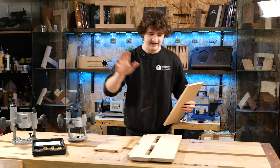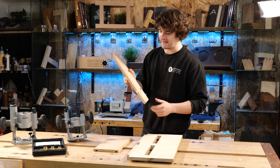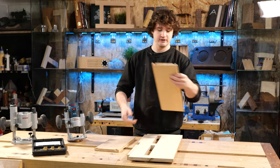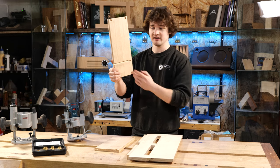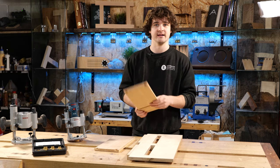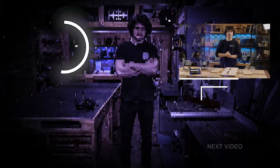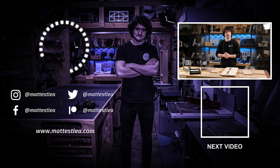And there you go — that's how you use a router with a special jig and a router table to cut the groove and the rebate for the cabinet. In the next video we'll be showing the hand tool method of cutting the rebate and the groove, and in addition I'll be showing you how to square off the end of the stopped groove — the router has left us with a rounded edge and we want that nice and square to fit the tongue on the shelf. If you're on my online school scroll down to find that video; if you're on YouTube click the link below, and don't forget to press subscribe.